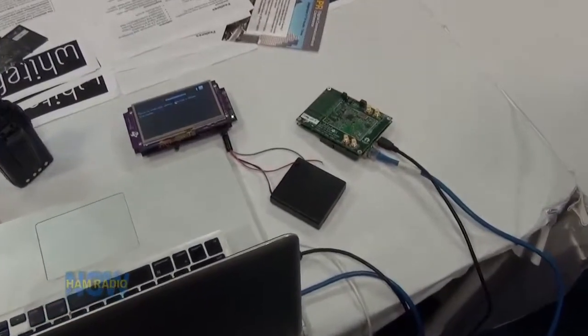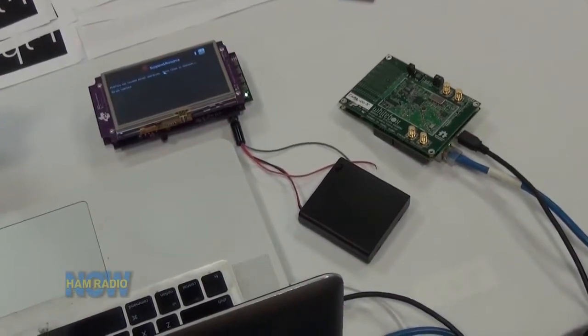The age of knobs has passed. So where do things stand now? What can this do and how soon might we see something come next? About six weeks ago I got the transmitter fully operational and heard my voice come through using single sideband on another radio — I was jumping up and down because it's been a few years that I've been working on this. The plan now is to keep improving the noise floor. Because this is my first radio design, there are a lot of pieces to understand and evolve. I'm coming off of a number of months working solely on this to finish getting the transmitter working. I still have to finish bringing up the receiver, but things are looking good.